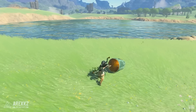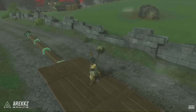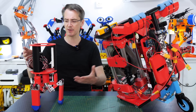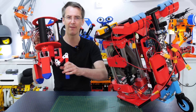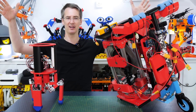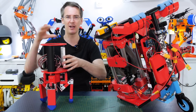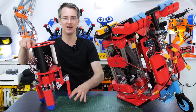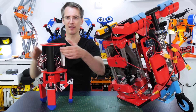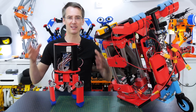It's not quite as good as the original which can pick itself up from lying down and seems to work in all axes — that would require another pair of gyros — but it does look like it's physically possible. We're going to need a much bigger tripod robot than this to carry something like this, but the plan would be that it would be much bigger, then we'd have the gyro unit rotating around on the top so it would rotate over two legs, and then it could pick up the third leg and balance using the gyros. Then it would rotate around again over another two legs and pick up a different third leg, and that's how it would walk along. But that's a whole other project!